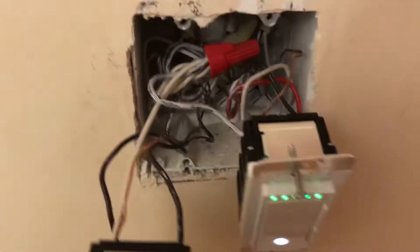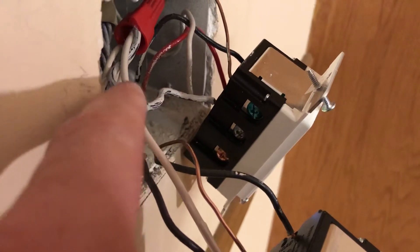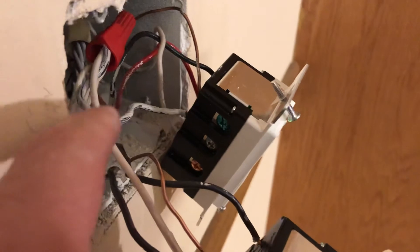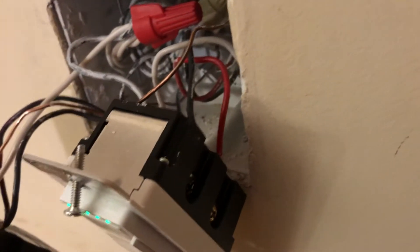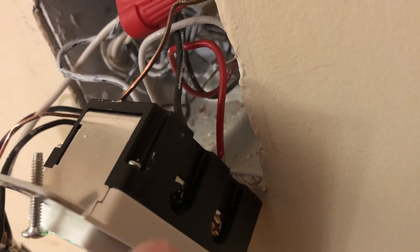The wiring goes like this. Looking from this side, the green one is ground. The next one is neutral — I added one line to the neutral bundle. So neutral goes to AC neutral, one goes to ground. I'm installing it towards the load side, so the black one is load, and it goes to the load terminal.